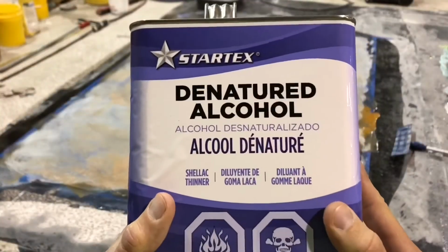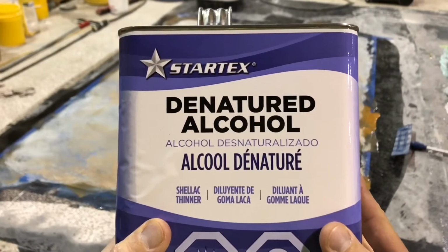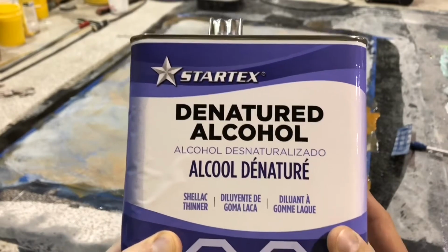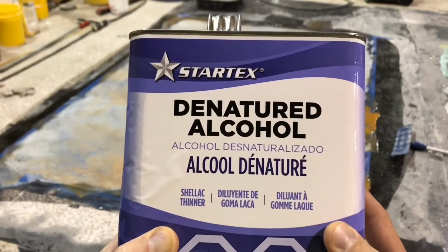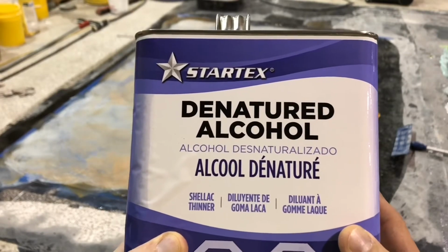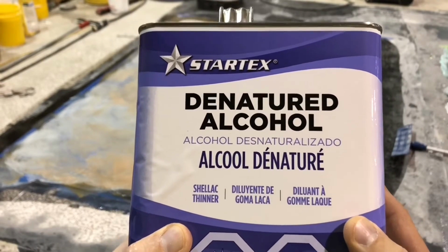It's very important to use good solvents. For this one, we use denatured alcohol and the contact microfiber to swab the whole surface, to clean it of all the fine dust, to clean out everything that can possibly be removed from any of the pores or the scratches or anything that's in the floor, so that when the urethane is placed, it will thoroughly bond.